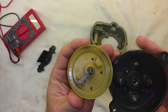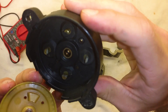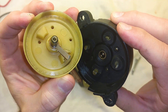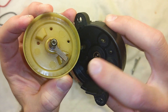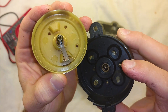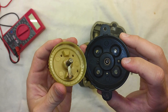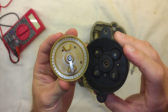We can see this one is kind of burnt up — there's pretty good amounts of wear on some of these posts where the electricity has jumped across. Sparks are incredibly hot; they generate thousands of degrees of heat, although it's very small so it doesn't catch fire. That's pretty worn out there, and that might be part of our problem. But since this thing totally failed and wouldn't make any spark, that could be it since it would be common to all four sides. If it was just one of the posts, we'd have some spark still coming through.